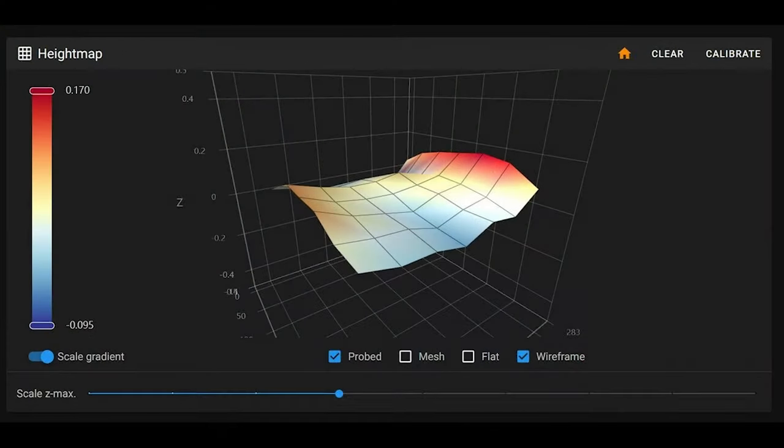From this, the system defines a bed mesh that describes the print surface as having these minuscule peaks and valleys throughout — that will look something like this. It may look a bit violent at first, but if you look at the scale, we're talking about fractions of a millimeter in deviation. Remember, we're trying to print layers that may only be 0.2 millimeters in thickness or less. Once done, the system saves the new calculated print bed mesh and applies these precise offsets to the subtle ups and downs throughout your print. Trust me, this is huge when it comes to getting prints to work and look great.